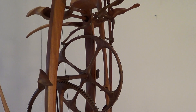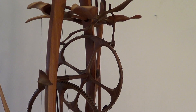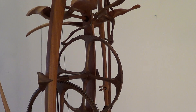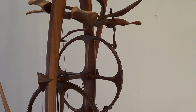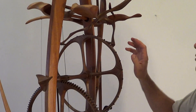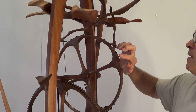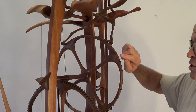So that just leaves dusting occasionally as desired, and lubrication, which I'll talk about first. Nothing on the clock needs to be lubricated unless there is a specific issue that arises. And usually that would be if it's extremely humid weather — the outer edge of this wheel may have a bit more friction on it.